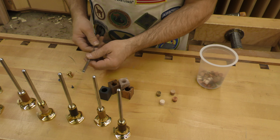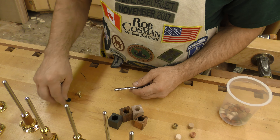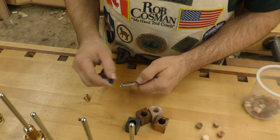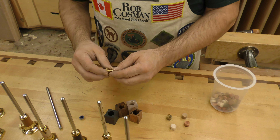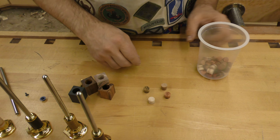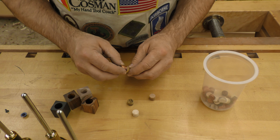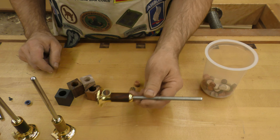Finish off the body. There's our stainless steel rod — we have that drilled on center. And I use the screw. And then there's our cutter that we have custom made. These are new ones so they have a very acute angle on there, so they really cut nicely, particularly into hardwoods. Once we put that on there, we sharpen that up so that it is razor sharp when it comes to you. So there's our thumb screw. I hollow the center out, and then using the little tiny scraps we have left over, I cut a bunch of half-inch plugs. Sometimes I have to cut it several times to get that to fit, but we get that down in there, glue it in place, finish it off, and you end up with something that looks like that.